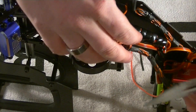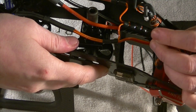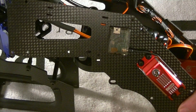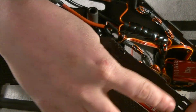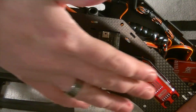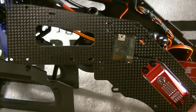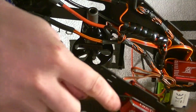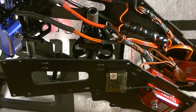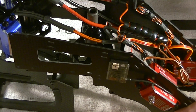This will tuck in. What I did is I manipulated the heat shrink and arced it, and then I've got my satellite already pre-installed. I put some heat shrink onto the antenna and molded it — manipulated it with heat — so it sits right on top of my servo. My servo arm is going to be down here, so it won't interact with that satellite. I've got one on each side, with one antenna going forward and the other going backwards, for optimal signal reception.